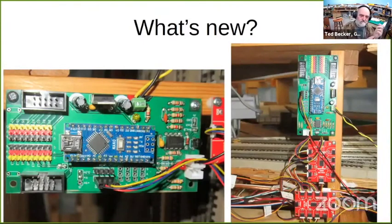All right. Here's one of my latest installations. This is my newest node board. It takes a Nano. Here on the end is the receiver circuit, and now for those, I've switched away from the RJ45s, and I use these little 2-pin JST connectors.